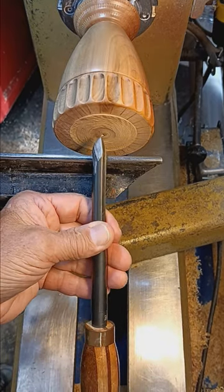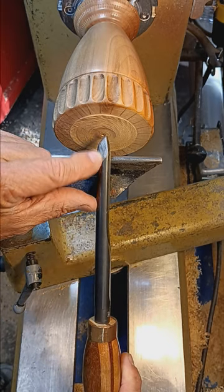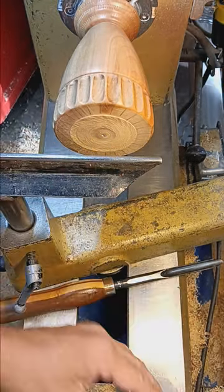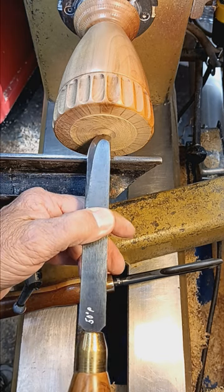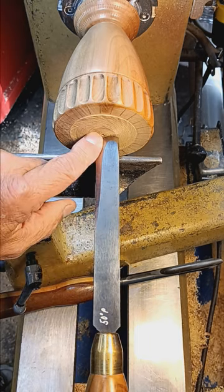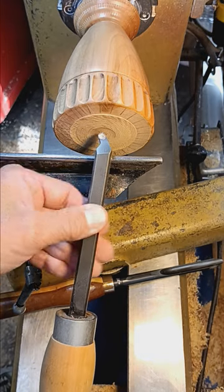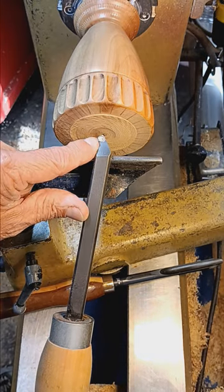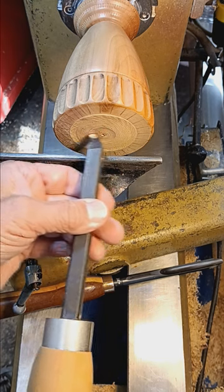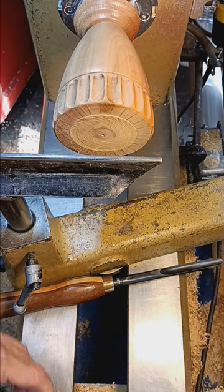The tools I'm going to be using — I'm going to start with a half inch spindle gouge. I grind mine using my bowl gouge jig so that I have these shoulders; I think it cuts a little bit cleaner when I do that. The other tool I'm going to show you is a negative rake scraper. You could use a regular scraper to do this, but if you use a scraper you're going to have to center drill it first. The other tool I'm going to use, which is the one I use a lot nowadays, is the Hunter Viceroy. It's a cupped carbide cutter and it actually cuts instead of scrapes. You use it like a scraper — I'm holding it flat and I'm just cutting from the center out, although I can push it straight in if I've already pre-bored a hole. But let's start with the spindle gouge first. This is the most traditional method that people used for years.